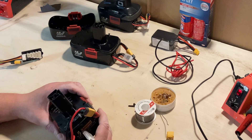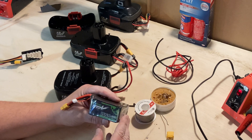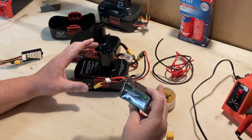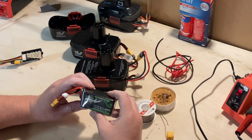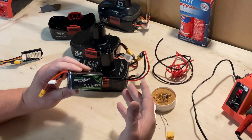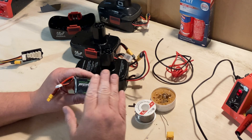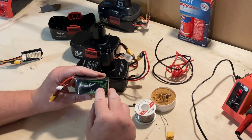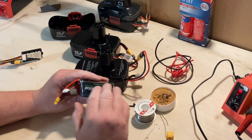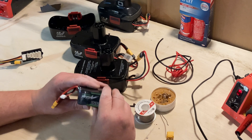The five-cell LiPo batteries are what you need. Five cells give a nominal voltage of 18.5 volts. People might ask — these are 19.2 volt tools — but there's a wide range of voltages these tools work at. The original NiCad batteries can be as low as 17-18 volts when nearly dead, and as high as 22-23 volts fresh off the charger. When five-cell LiPo batteries are fully charged, they charge up to 21 volts at 4.2 volts per cell. Lithium also stays at that high voltage level for a long time — you don't see the linear voltage drop-off you get with NiCad.